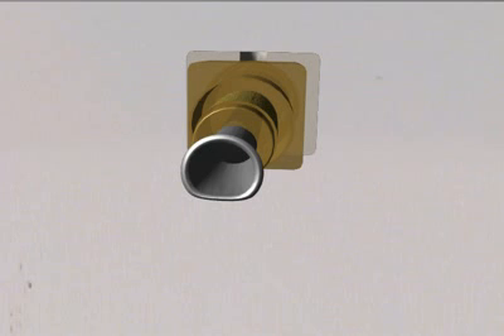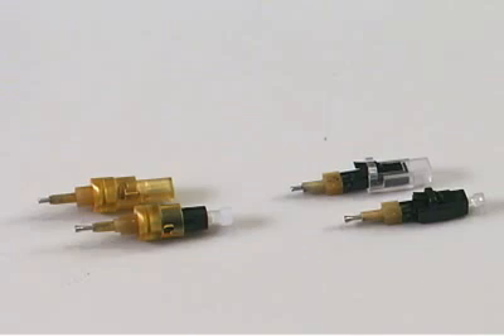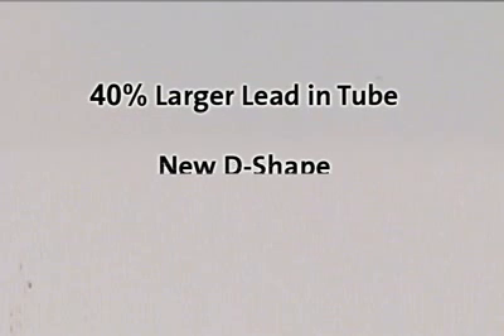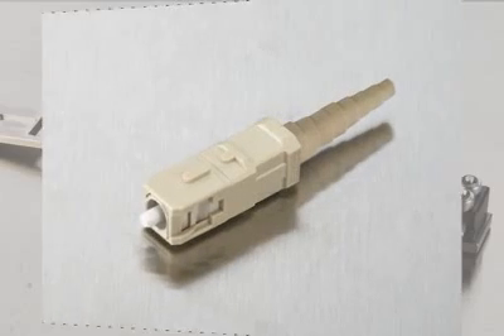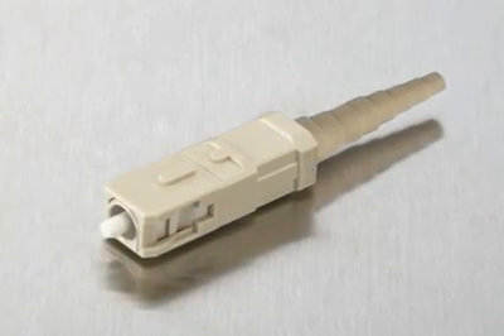Finally, in anticipation of a new Unicam connector installation tool coming in early 2007, we've made some modifications to the dust caps used on Unicam ST and LC connectors, adding a new black load adapter dust cap. These changes do require some minor changes to the critical steps used to install ST and LC Unicam connectors with the current TKT Unicam installation tool. This video will outline these critical steps for you. Note, there are no changes to the critical steps for installing an SC Unicam connector.